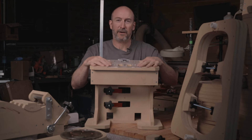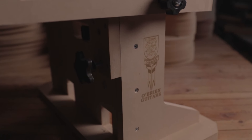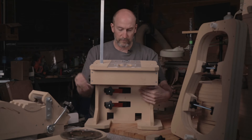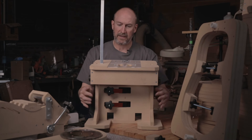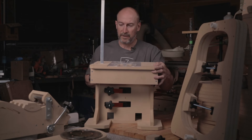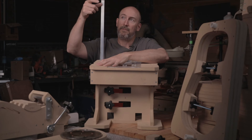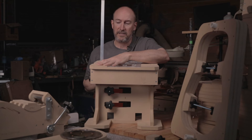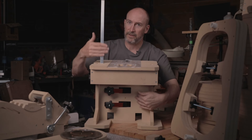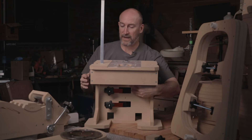The last thing I want to show off today is the O'Brien Guitars mortise and tenon jig. Some of you are familiar with this — Robbie has sold plans to build these, LMI built their version, and this is what Robbie and I are calling V3. It's a redesign: the old versions had a plate that went back and forth down here, and we redesigned it to simply use two thumb wheels to loosen up the top and tilt it. The big idea is you put the body of your guitar here, then tilt this platform until the space between the rod and where your bridge goes is the right dimension, then lock it in.